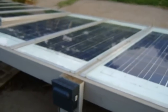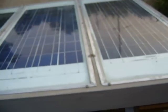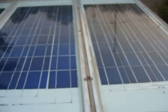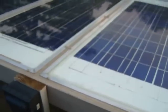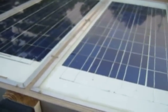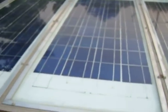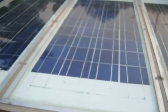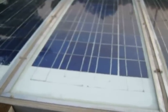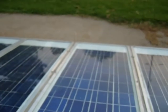I'm going to have to invest in some wire. Wire is pretty expensive, not as expensive as solar panels, but expensive enough. So if you're going to make or buy solar panels, count on buying some good 10-gauge wire off the internet — fine stranded preferably. I found some with 101 strands, which should be good 10-gauge wire. I'm going to order it anyway. Thanks for watching.